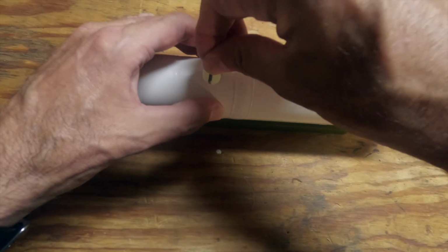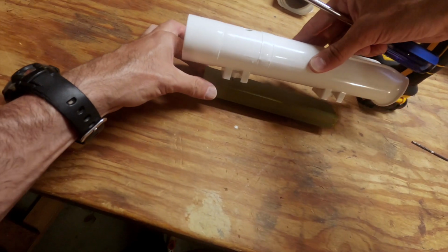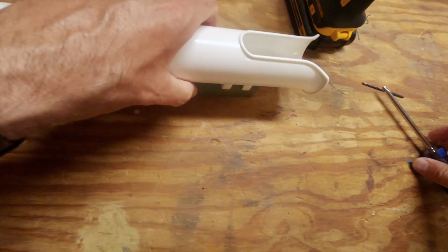Step 3 is attaching your accessory to the wood. Drill a small hole and attach your accessory using a fastener. Make an effort to get some stainless steel fasteners because they won't rust, and in the long run, they look better on your boat.